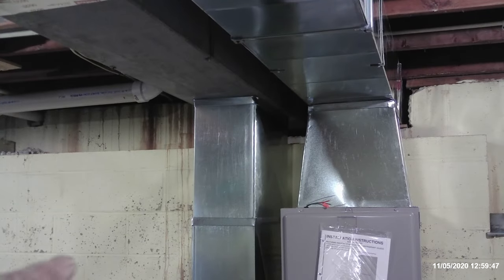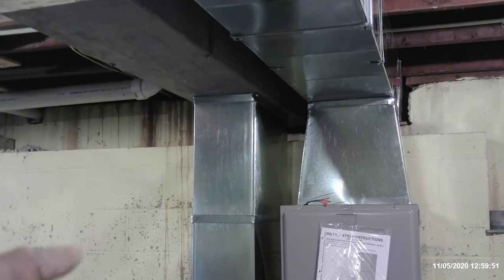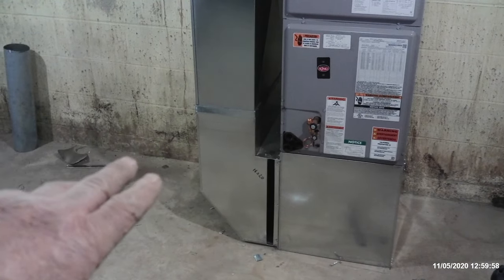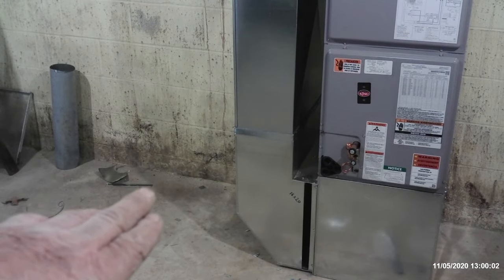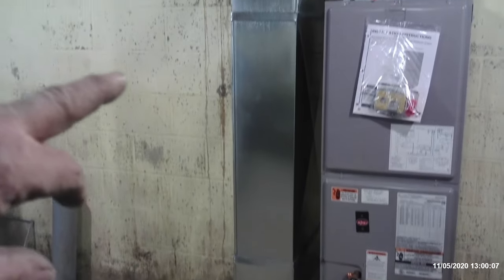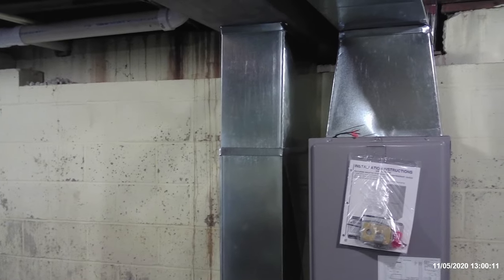So here you have it, the most recent sheet metal projects: the Centerline two-way transition, the return air plenum box that the furnace sits on, the return air 90 degree elbow with the incorporated 16 by 20 filter rack, and of course the connecting ducts to go into the return air, fully installed. So there you go, that's another quick little installation. He's going to take care of everything else. All that done with just a little bit of sheet metal adaption. So the job is in and complete.